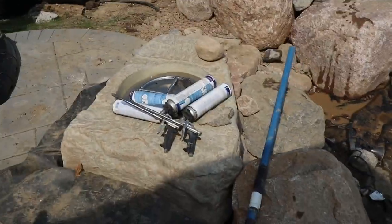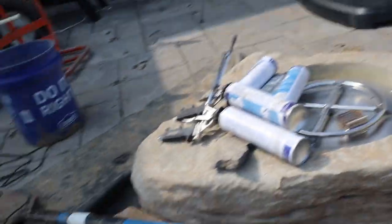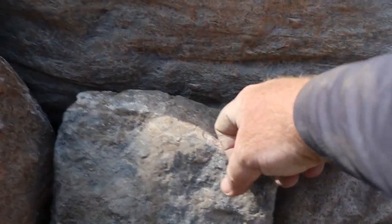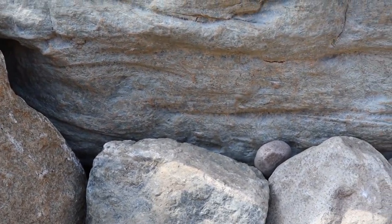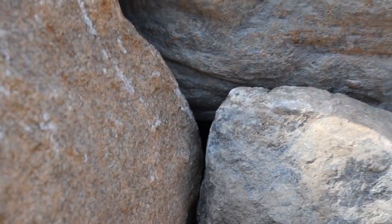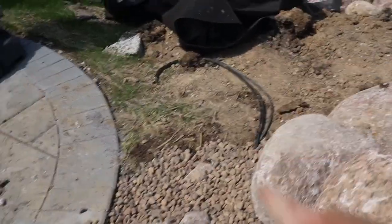All they've got to do is trim the liner up into here. Super important guys — if you're ever going to carve it in so water comes up the face of it, you have to make sure the bottom of the fire rock is above water level. All of the components — the control panel and everything — are inside of this. If that gets wet, you're in trouble. We've got about an inch of water touching the base of that rock and we should be okay. There's our gas line and electric start over there.